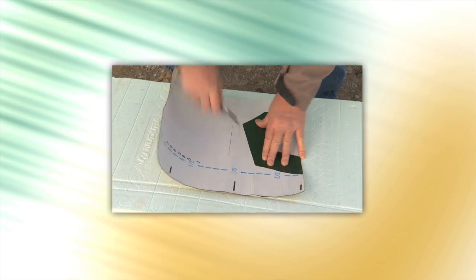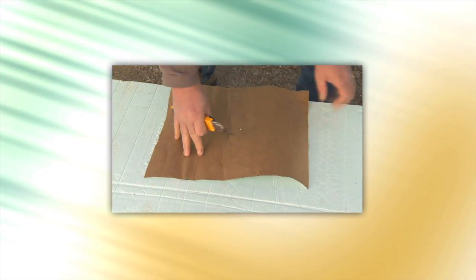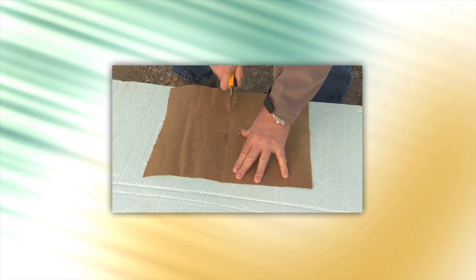For service or utility penetrations, cut a 12 by 12 inch or 305 by 305 millimeter piece of membrane, then use the pipe as a template to cut 2 cross-cut slits at the perimeter of the membrane. Peel the backing paper away once the piece has been placed over the pipe to avoid it sticking, and slide the piece into place. Press the membrane piece firmly into place, sealing the flaps against the pipe.